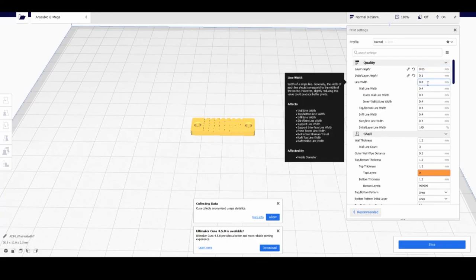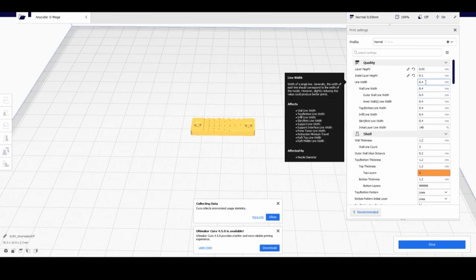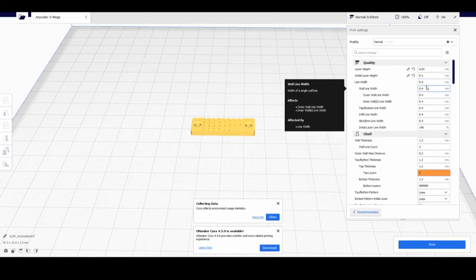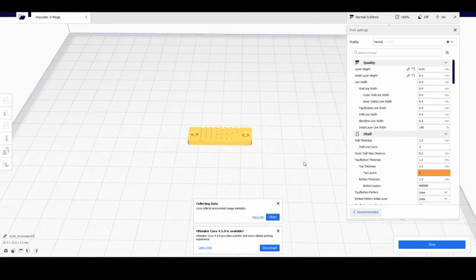And the line width, the width of the filament that is going to be extruded on the side, will still be 0.4, and I can change it obviously in software, but it won't do anything for the actual printer. The printer will still just jam through the filament. If you don't make this properly, the filament will just ooze out in strings and not do anything.